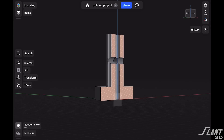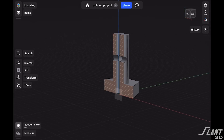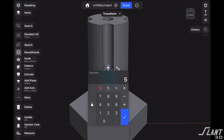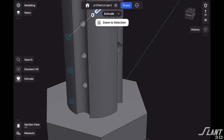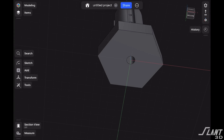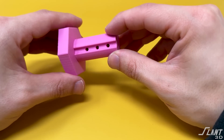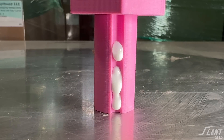If a rod is very long, you need more areas for glue distribution. In that case, you start putting depositing holes all the way along so that as you purge glue through the core bore, it's able to come out the sides of all of these different holes. This gives you very equal pressure dispersion and ensures a uniform dispensation of glue throughout the entire length.